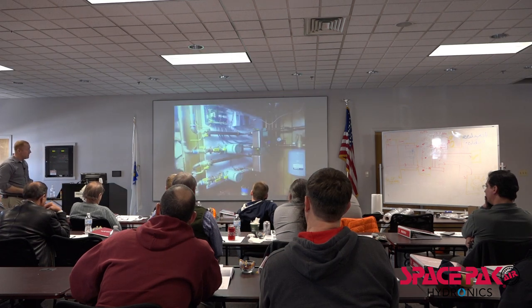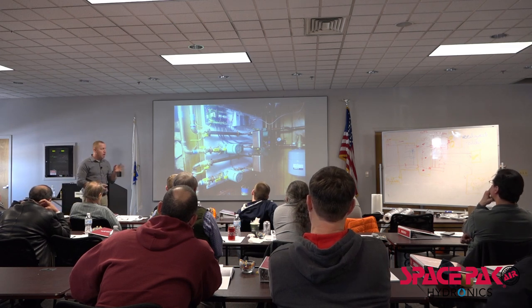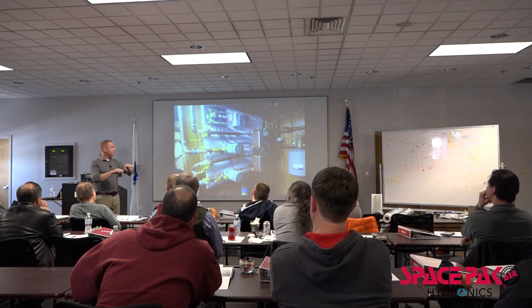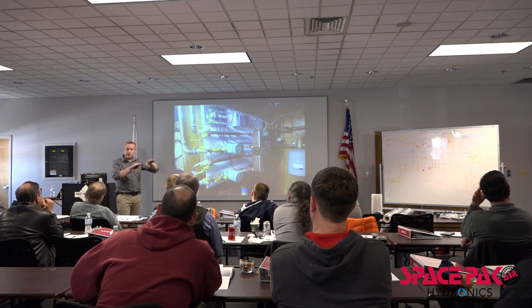So here's an application. This was that 900 gallon in the basement with plate heat exchangers. Now, this works really well until it gets close to set point, right? When it gets close to set point, we don't have the differential. Plate heat exchangers work really well if we're 100 degrees on this side and 140 on this side and we're trying to transfer heat back. The closer those two sides of a plate heat exchanger get, especially within that 5 to 7 degrees of variance from one side to the other, they don't work as well.